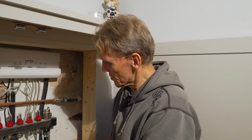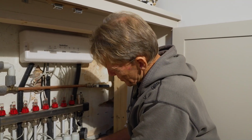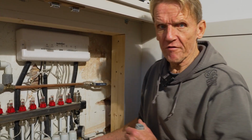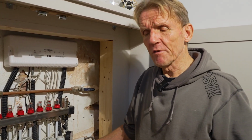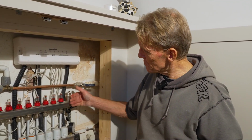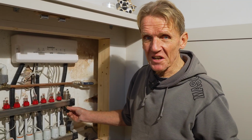And I would recommend that if you've got an underfloor heating system and you think, okay, it's been in a few years, it might not be as warm as it was, then the thing to do is just give it a quick flush through and then put some more inhibitor in it afterwards, and you should be absolutely fine. People often worry about underfloor heating systems. Oh, what if they get all sludged up like radiators? Well, there's really no problem, because these manifolds are designed to let you blast it through with mains pressure and you'll get rid of everything.